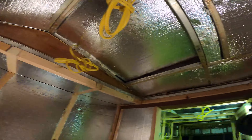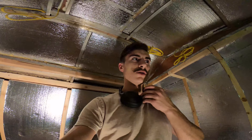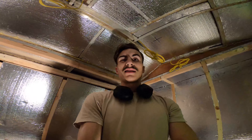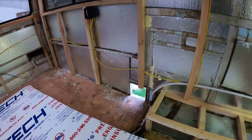Got most of the walls insulated and most of the ceiling, but I ran out of the big pieces of insulation so I'll have to go pick some up tomorrow. Last thing I'm gonna do for today is use the spray insulation to fill up all the small gaps. I got another piece of foam so I should have enough to finish up the sauna area, but before that I want to seal up a couple of small holes on the outside since it's going to rain soon — glue those in, seal them, and then get to work on the actual foam.